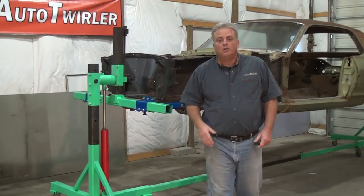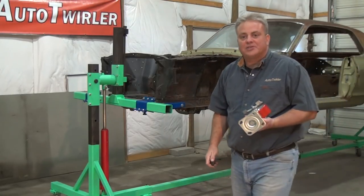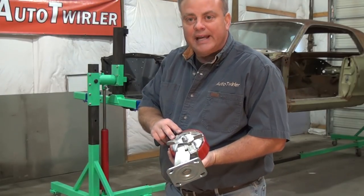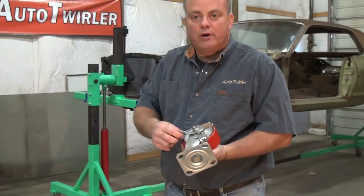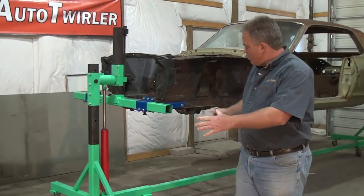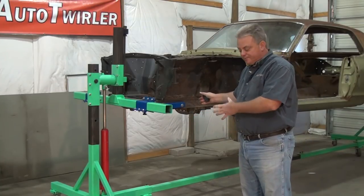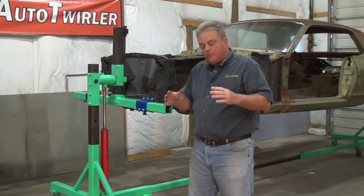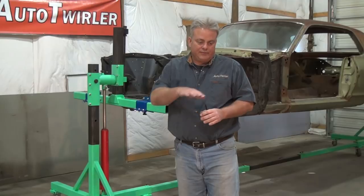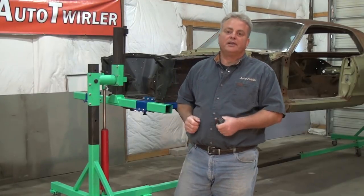Lastly, we've got six wheels on it — six casters. That's a polyurethane over cast iron caster, heavy duty, 880 pounds per caster. Four of them have brakes so that we can wheel this thing up when it's still on that body cart. We can wheel each end up independently and bolt onto the unit. If you want to roll it around the shop, you can do that. If you're on a slight slope, you can lock the brakes down so you can grind on it or push on it.